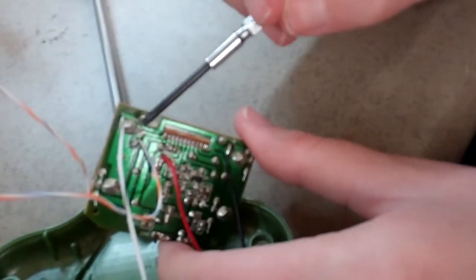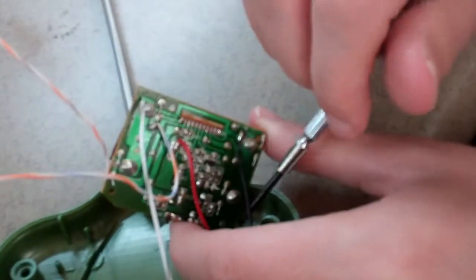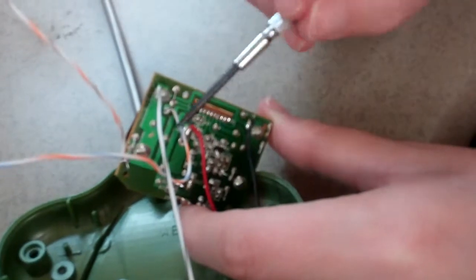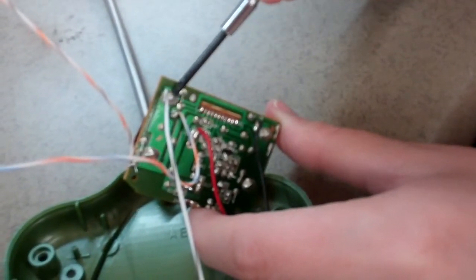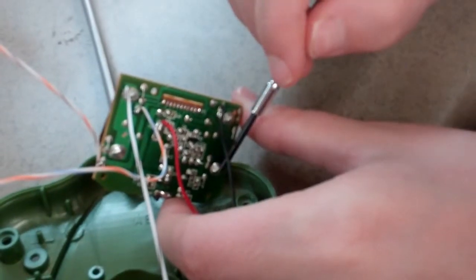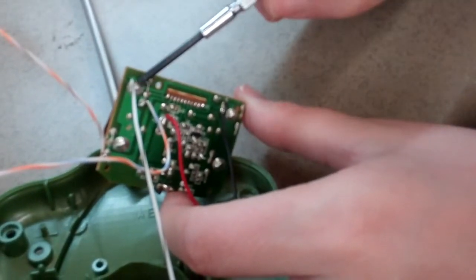You'll attach a wire to left front, left reverse, right front, and right reverse. You'll also need to attach a wire to the ground, which you can find by following the green trace to the other side. You can attach the ground to any of those points — we attached ours to the most easily accessible one.